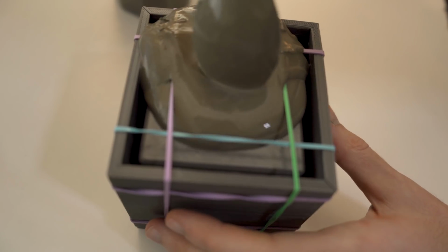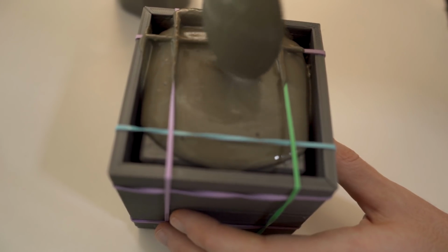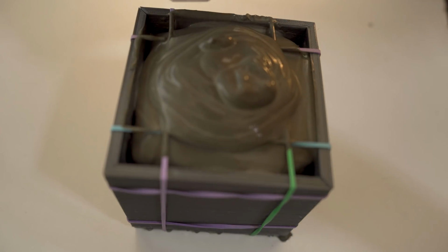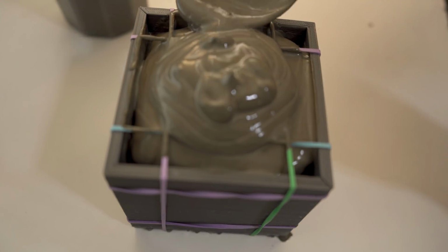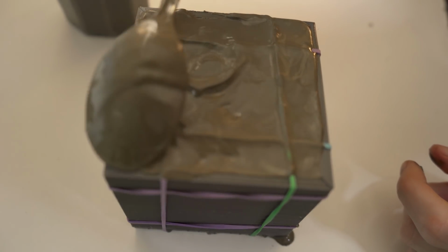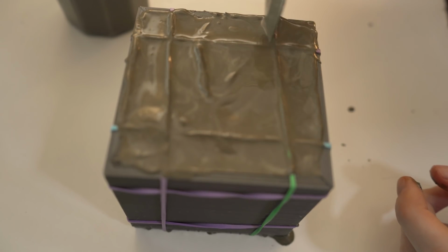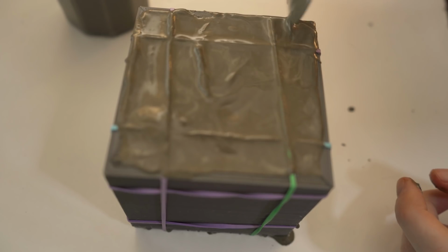Just as a word of caution, if you're pouring something that has to be mechanically strong, then you don't want to add as much water as I did, since its strength decreases with the amount of water in the mixture. You'll also want to add an aggregate like sand or rocks to increase its strength even more. The YouTuber Practical Engineering actually made a great video about the properties of concrete, which of course is linked in the description below, and I highly recommend you watch it if you're interested in that kind of stuff.